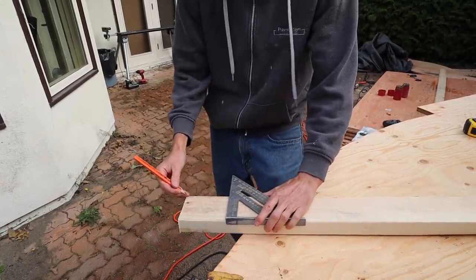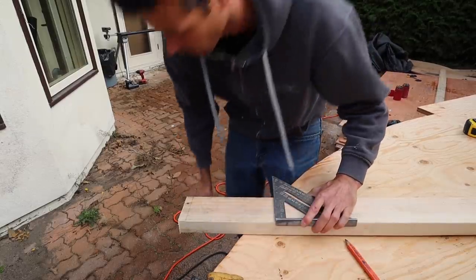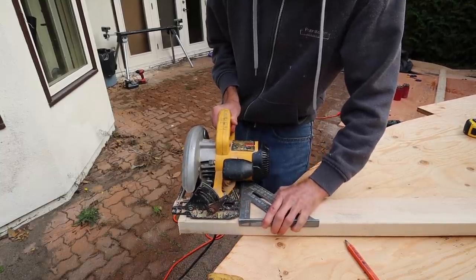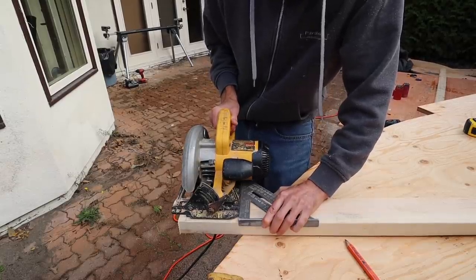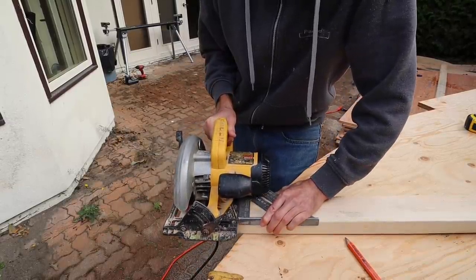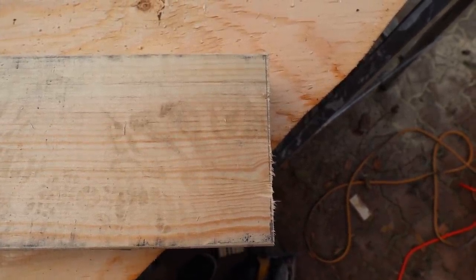If you've got a little line you're going to, you can have your line here — let's say you need it right here, you just need to cut this little bit off. What you do again is eyeball your mark like so, get it started. I'm gonna cut about a 16th away from the line and we'll see how it looks. As we can see, it's really really square.